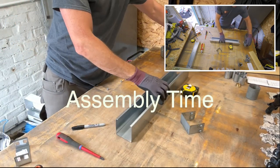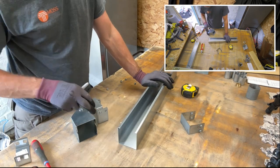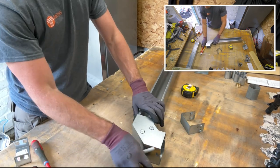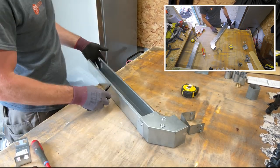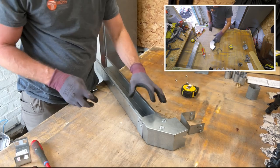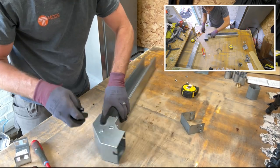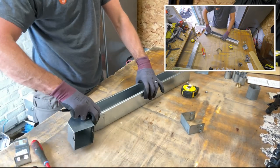Right, so you'll obviously know if you've worked with metal trunking before, but it's not like plastic trunking where you just butter fitting up to it or miter it. The ends generally need to be drilled if you're not working with one of the pre-made ends. Now this is, so we get that butted up to there, and then we can mark our fixing hole there, and on that one there, so we've got that to drill.